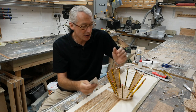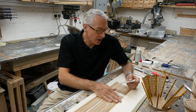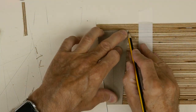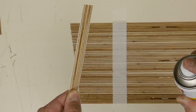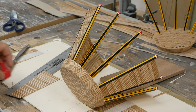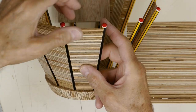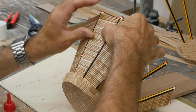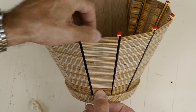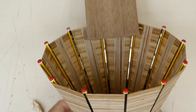I've started with a slightly larger template and then I'm trimming this down, cutting the strips of plywood to fit, and then gluing them in place. Using my cardboard template, I can mark out the shape, and then glue in the center support with MitreFix before cutting it out and trimming back the top to size. I'm using MitreFix again to glue the panel to the pencils, carefully working my way around the bowl to try and keep a consistent panel gap. And finally we've got the last one glued in place, and because everything was pre-oiled, there's no extra finishing needed.